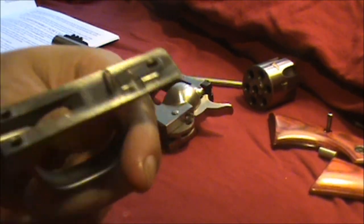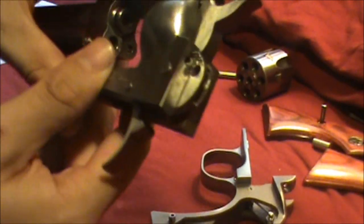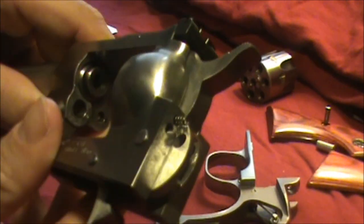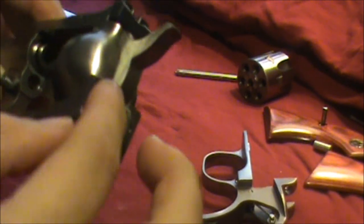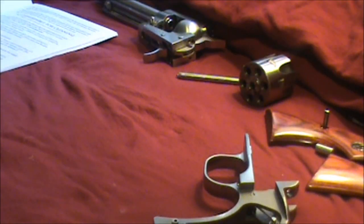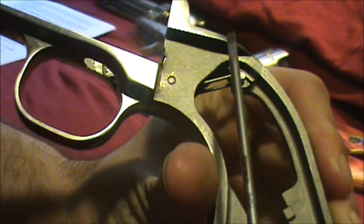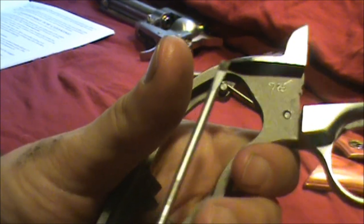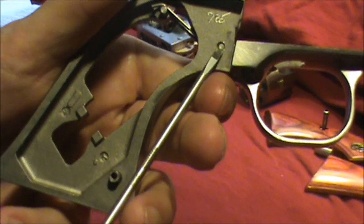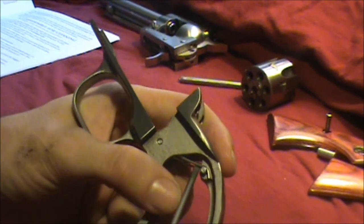We've got the grip frame here. Take note that we do have a small plunger here, so we're going to take that out and set it aside. We also have the trigger return spring in here — this is the part we're going to be replacing. We also have a small plunger at the back that goes in opposite — the dowel end goes inside the gun. Now we're going to pull those little arms off the dowel on each side of the gun, and then punch out this little retainer. It's actually really easy — it just pushes out.